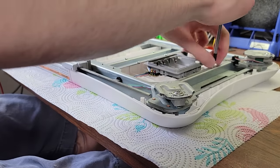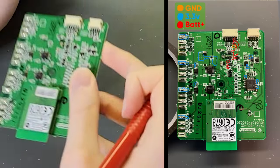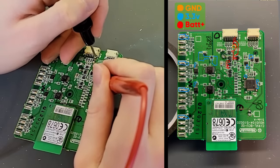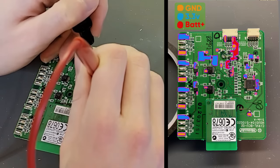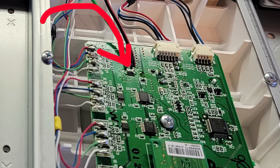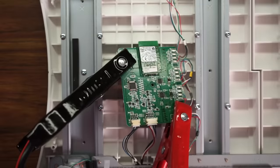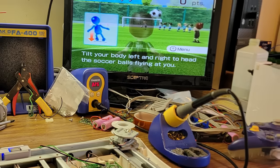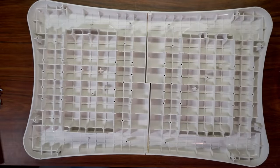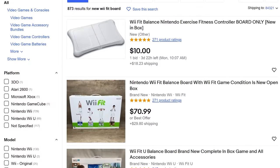While I wait for those boards to arrive, I'll spend my time working on the other parts of the project. I'm allergic to AA batteries, so I need to find a different way to power a Wii Fit board. I went ahead and diagrammed out the voltage lines on the main circuit board, and came up with a genius plan to power the board with a Wii instead of batteries — and my genius plan failed. My idea was to bypass the onboard regulators and use a 3.3 volt line, which did work up until the board tried to read the non-existent battery voltage and threw a fit about low batteries. So instead, I just said Oonga Boonga voltage time, shoved 5 volts in through the stock battery terminals, and that just worked. Now let's make the really cool move of using dangerous power tools to cut a big hole in this brand new Wii Fit board that I got off eBay for 50 bucks.